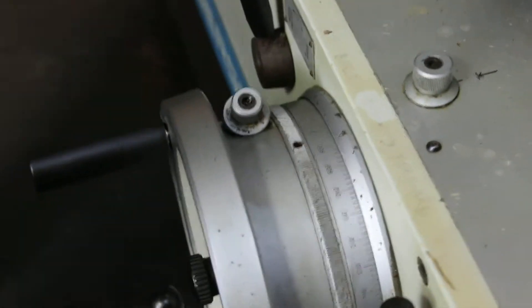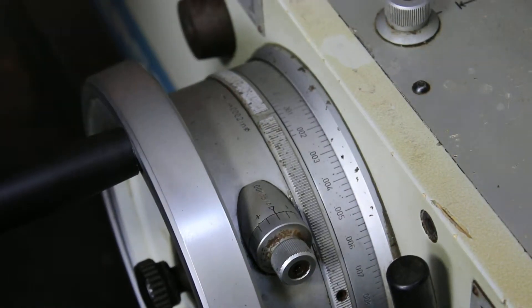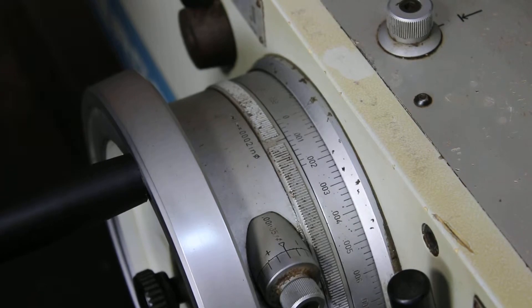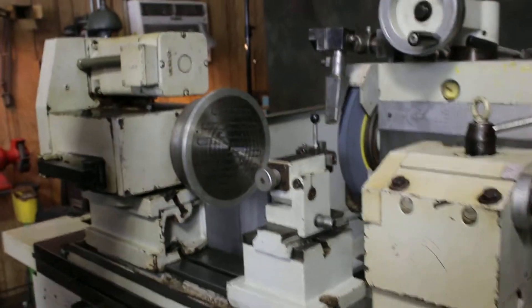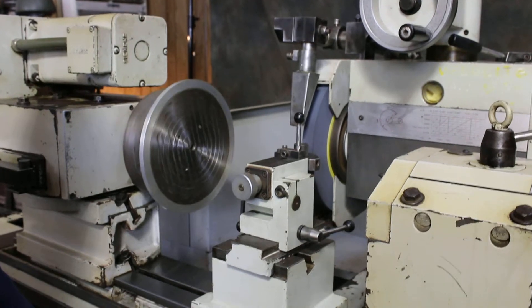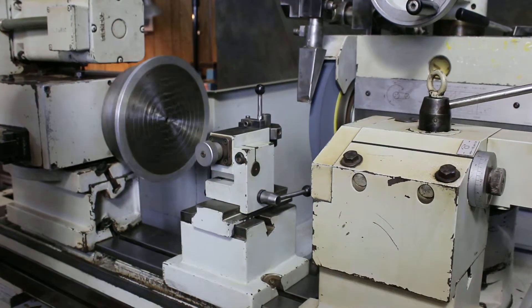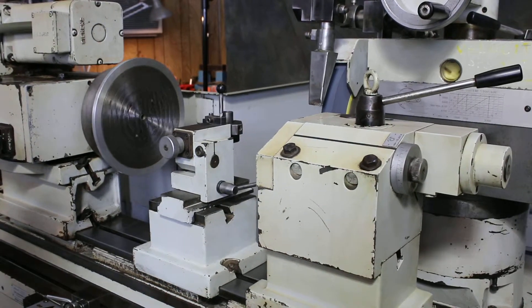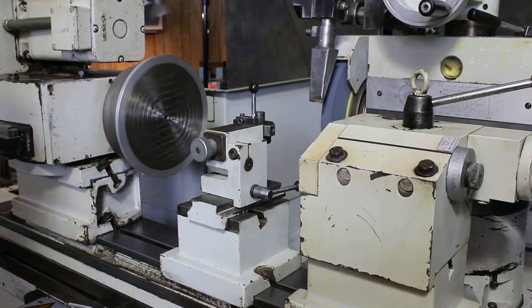The wheel slide comes in. The workhead speed is adjustable. Now we want to do a traverse grinding with the machine — we can put it in. It's kind of a mold. And each time the table reverses, we get a feed on the hand wheel.